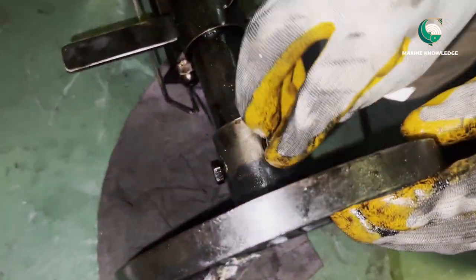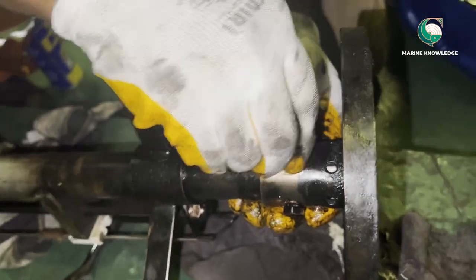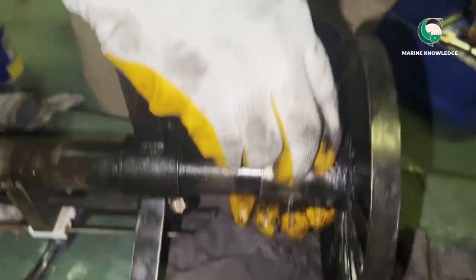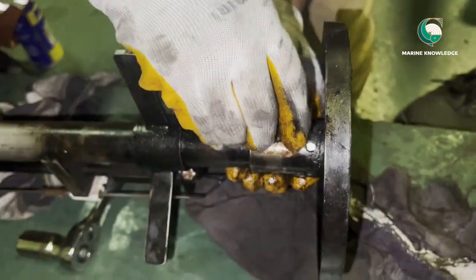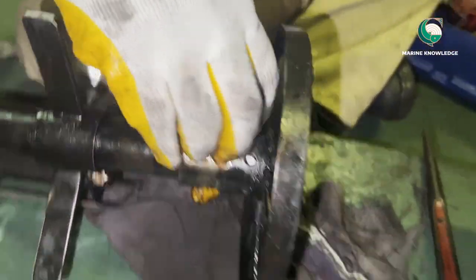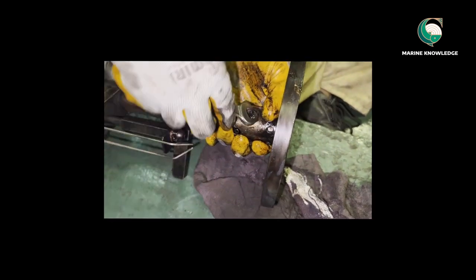These are the things you need to keep in mind while doing Burner Routines for a boiler: first go for the Pilot Burner nozzle and electrode, then go for the Main Burner nozzle and electrode. Any doubts should be cleared on the first time of maintenance work because after you fit back, if something goes wrong and your Chief Engineer asks you, you have to eradicate all those things. Do the job correctly the first time only so that you can avoid unnecessary hiccups after encountering any kind of problems.